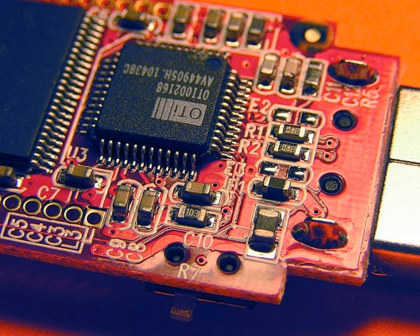With infrared reflow, the board designer must lay the board out so that short components don't fall into the shadows of tall components. Component location is less restricted if the designer knows that vapor phase reflow or convection soldering will be used in production. Following reflow soldering, certain irregular or heat-sensitive components may be installed and soldered by hand, or in large-scale automation, by focused infrared beam (FIB) or localized convection equipment.